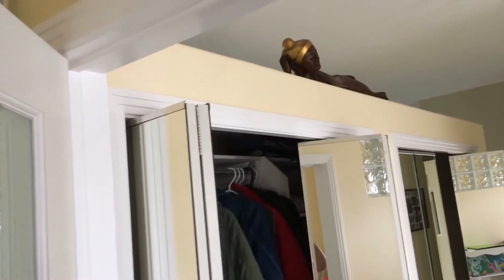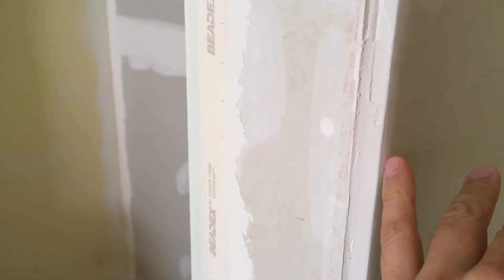This is almost all done — it's all taped inside. Now I've just got to do this corner piece right here, which is going to be a bullnose. I'm going to do bullnose also on the top because other parts of the house also have bullnose, so I'm just matching it. This bullnose goes right here — you don't nail this one. You just put the drywall compound on both sides, put it on, smooth it out a little bit and take it off.